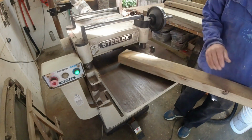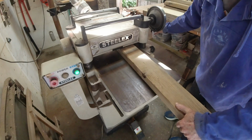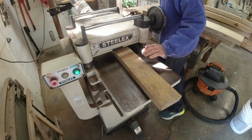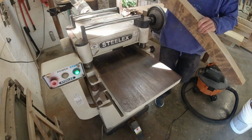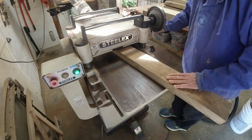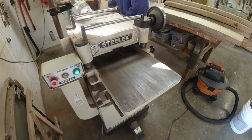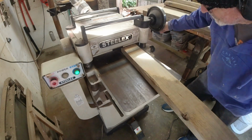So we get down to this pipe, which is 100 years old, and it was laid on lumber, which was kind of the norm. I think it still is, because when you get in a deep hole in New Orleans, it's just mud. You can't stand up. You can't do anything. So in order to stabilize this existing material, they often use wood mats to let the crews get down there. This was lead joint pipe, so even after it was laid, there's quite a bit of labor to get down in there and do the lead joint.